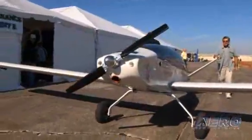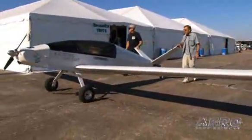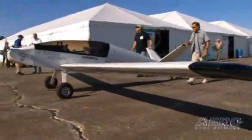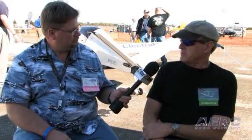It's fair-weather flying, no question about it. If it's minus 20, you can't charge the batteries — they won't accept the charge and you may even damage them. Any chemical reaction slows the colder it gets. You can discharge your batteries when it's cold, but at a lower rate — you can't get as much power out of them, and you can't charge them at all. It's just the nature of them. The range we can use it in is probably 40 or 50 degrees up to about 100 degrees Fahrenheit.